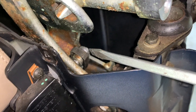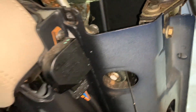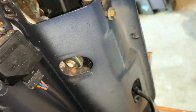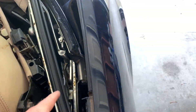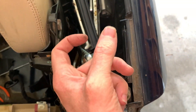Lift up the cylinder and with my other hand push the pin on. Put some grease on the screwdriver, put the clip on the screwdriver, set the clip onto place, then held the clip and pushed it down. Did it first try - seemed harder than it actually was. I also had a magnet to try and catch it if it fell. The bottom pin is going to be more tricky. For real, these bow cylinders are the most annoying thing ever.